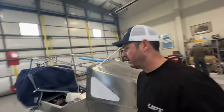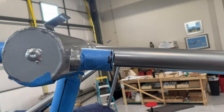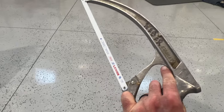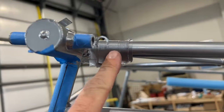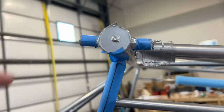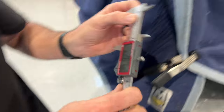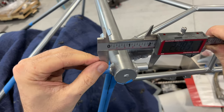We're going to start taking some measurements. I'll get some time-lapse to hopefully show these wings going on without a hitch — that's the plan. We got it marked — the further-out mark, the small one is 46 and 3/8 inches. I backed it off just a hair so I have the ability to correct anything with a file. We're going to use a brand new hacksaw blade, 18 teeth per inch. I kind of nicked it so we cushioned it with some duct tape. We'll remeasure, get a file out, clean it up, and move on to the front side — 2.283 inches. That's quite a bit of material we've got to take off.